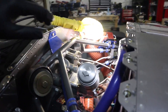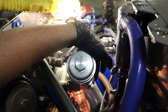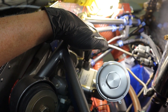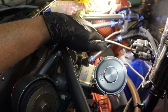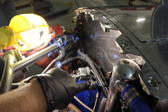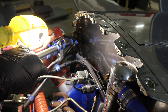On the back we have the oil filter and the oil temperature sensor. There's also a fitting for a manual tachometer attachment if desired. Up on the firewall we have a fuel pressure sensor and oil pressure sensor plumbed in, which feed into the engine monitor.